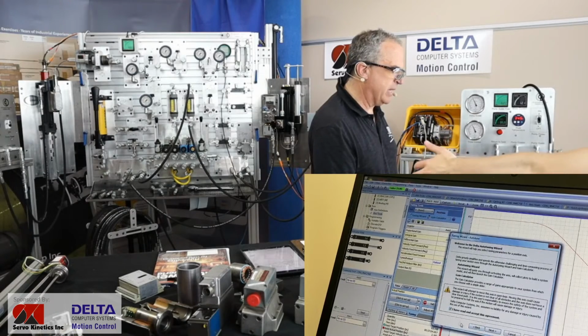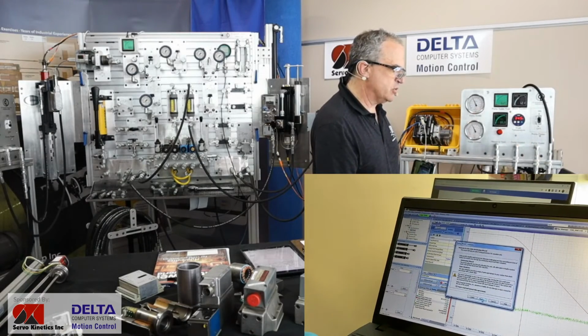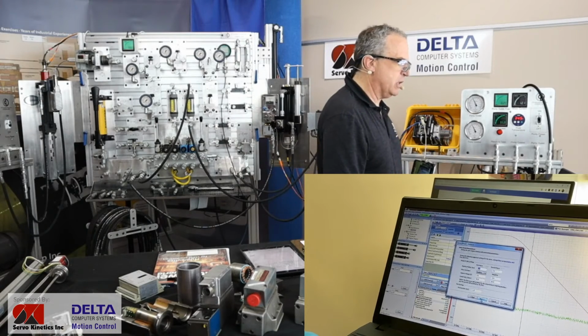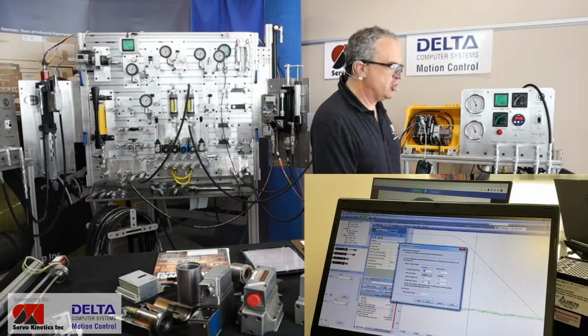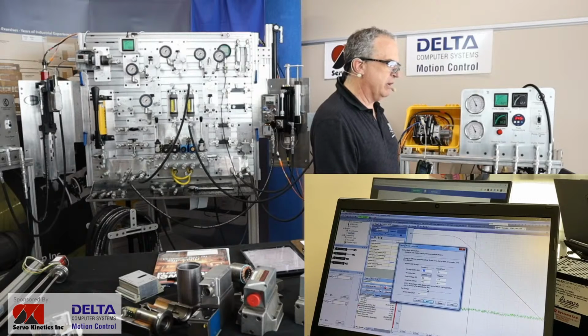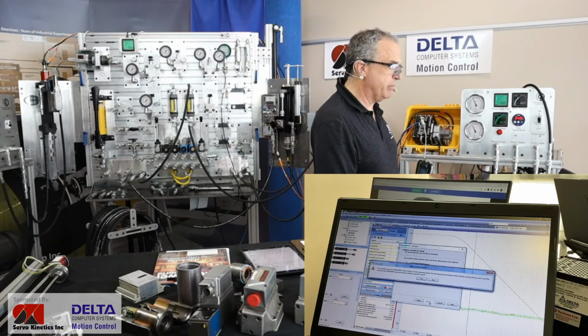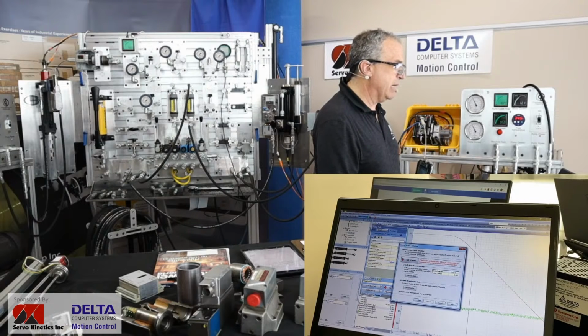And a warning that I might make some very heavy or dangerous equipment move in my plant, and be careful. And then the standard 2 moves in each direction should work. And some parameters I could change if I want to, but quite often the starter parameters are just fine. There's going to be one move where we extend the cylinder and see what that's like working against, and our cylinder is very lightly loaded, and then another move, negative, where we're going to retract the cylinder, and the MDT feedback, and the response of the system will be automatically, oh, I didn't put my, there we go, I got to put my controller back into the program mode.